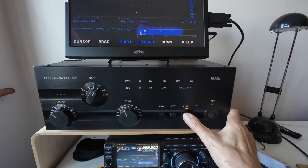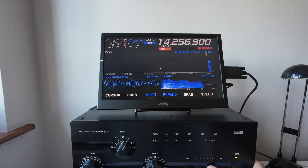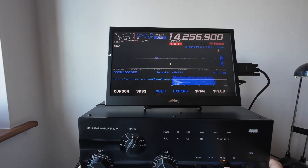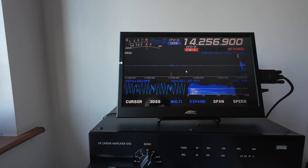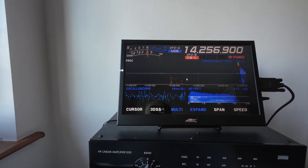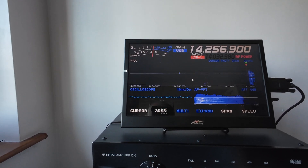The antenna is resonant just outside the bottom of the 20-meter band — that's because the 49:1 unun adds a little loading, so the antenna needs to be shortened slightly. But you'll get the same VSWR and can move resonance to wherever you like in the band. Listen to an S9-plus signal on the dipole — now going to the vertical. The horizontal dipole and vertical show no difference between those two signals at all. The S-meter is pretty high; switching between the two antennas you can't hear the difference — the vertical is working very well.